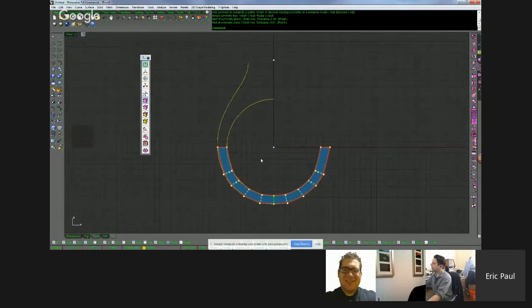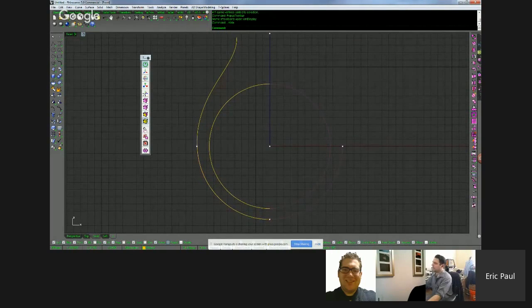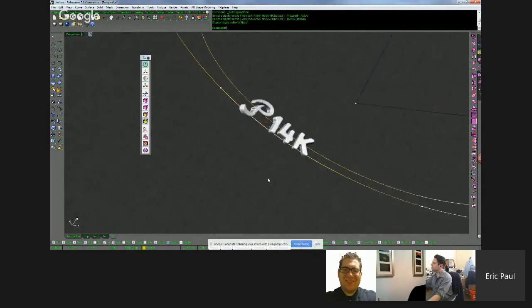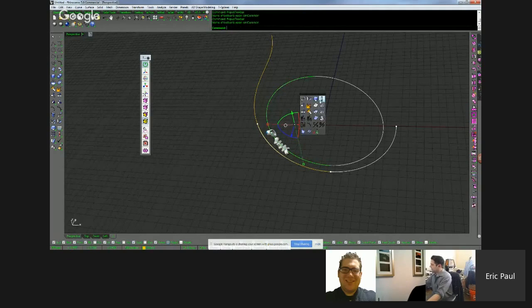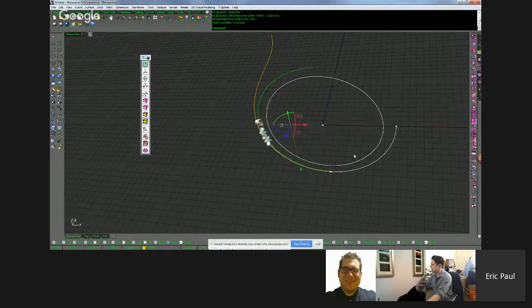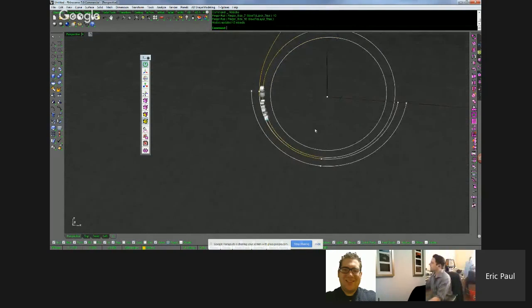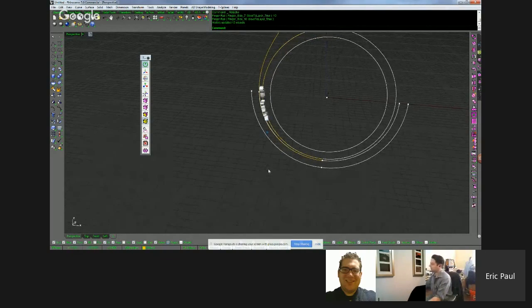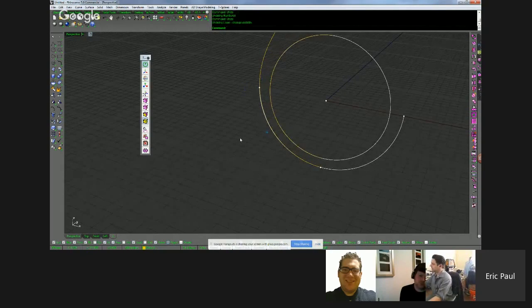and then from the front view, I have these, and I'm sure they're on 0 because this is my template file, and I make sure this starts on 0 because a lot of things run off of this curve, like, for example, my trademark and carat stamp. So whenever my ring size changes, if I said finger size of 10, it's going to lay out that arc to give me a guide. It's going to update all the little things like this that are in my template file to match.